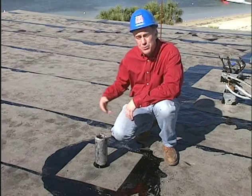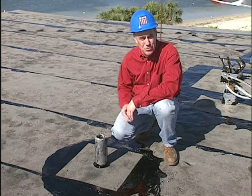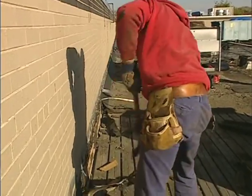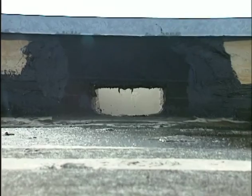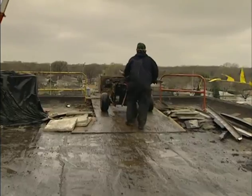You're already familiar with the field and the flashing, the 2 areas that make up a low-slope roof. Well, like the field, these flashings also have to be removed when you tear off an old roof assembly. Before you remove a flashing, check with your supervisor to see if copings, counter flashings, gutters, or scuppers should be removed. Get rid of all debris as soon as you can.